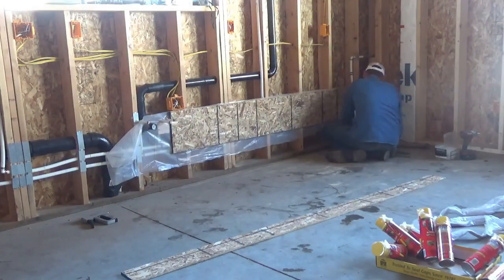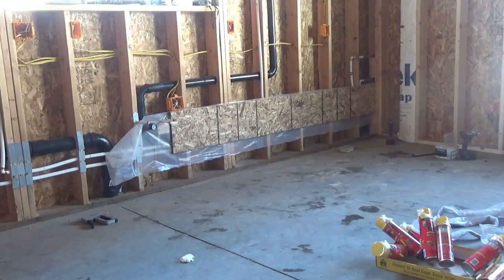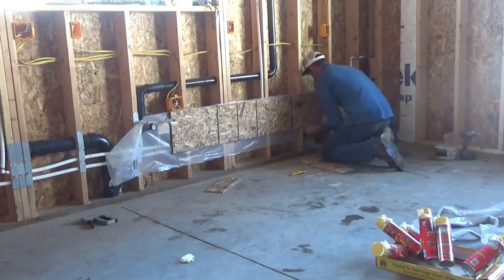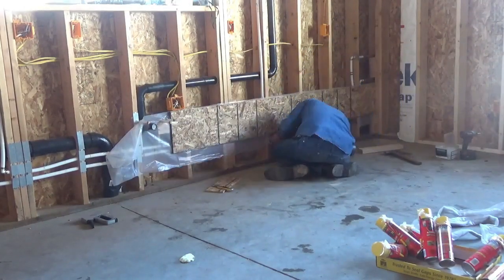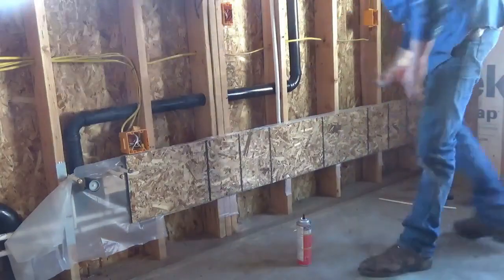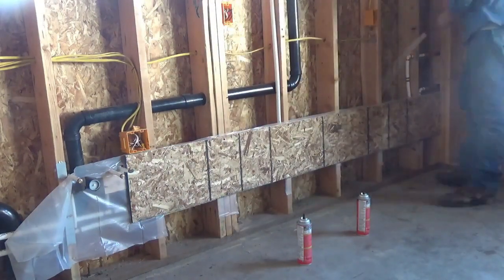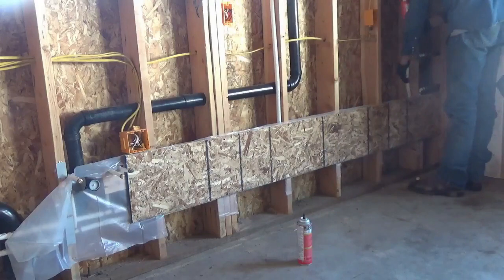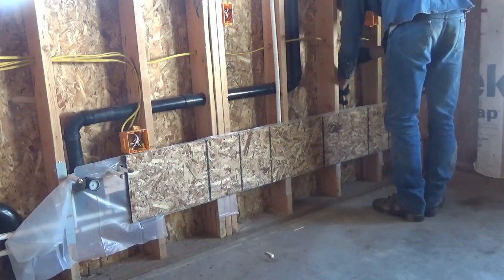All of the pipes that are in exterior walls — initially I was going to wrap them with Thermoflex insulation and then put Roxul behind it. I've since decided to use the spray foam around just the pipes, done in such a way that it's virtually impossible for these pipes to freeze as long as the inside of the house is somewhat warm. The urethane foam insulation has a much higher R-value than even the Roxul insulation does. The other thing that spray foam does that Roxul, fiberglass, or blown-in insulation doesn't do is it seals — it seals quite well. I'll end up using around 25 or 30 cans of spray foam.